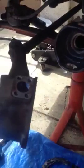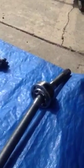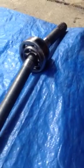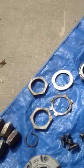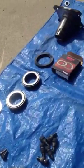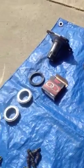And then I'm going to repack the axle. It's clean right now. I cleaned it with kerosene, and then I blew all of the old grease out with compressed air, and I'm going to try to do that to put the new grease back in. But these are all the components. Now this is backwards, and I'm going to do the other side too from the beginning, but this just kind of shows you how this starts out.